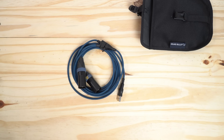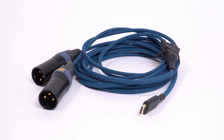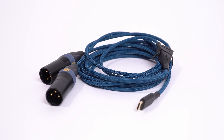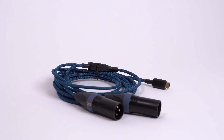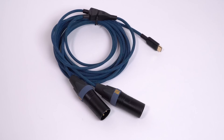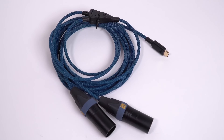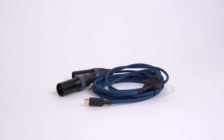With that said, what are we looking at here? It looks like it's just a cable — USB-C to XLR — which seems simple enough. When you think it through, though, it's not quite so simple. There's a lot to consider when going from digital USB-C to an analog balanced XLR output. As a result, this isn't just a cable. With minimal space, they've somehow made this a transformer-balanced USB-C to XLR class-compliant audio interface.